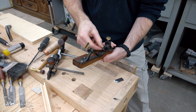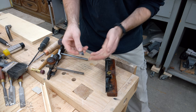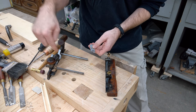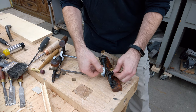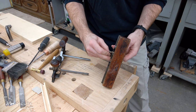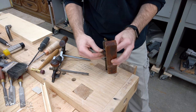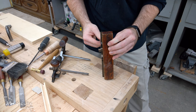There's the same kind of mounting mechanism in the fence for a blade, and that's exactly what it's for. This is the sash profile, and what this will cut is basically a small fillet, then a quarter round, then the rest of the profile, and then a rabbet for where the glass would go. This goes just like the other one into here, and you tighten that down. What you need to do is line the bottom of the cutter up with the bottom of the fence.